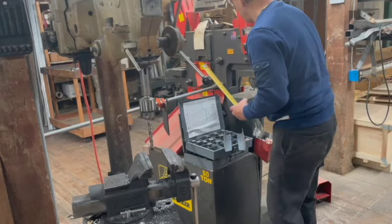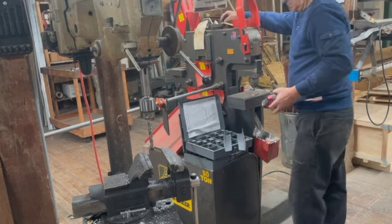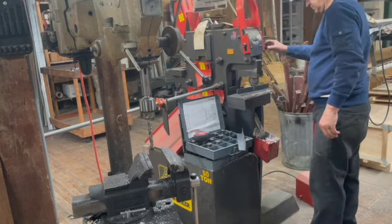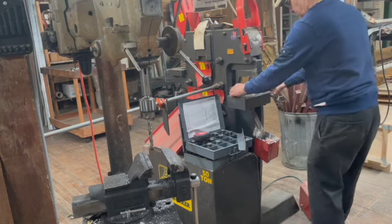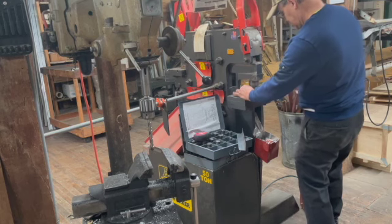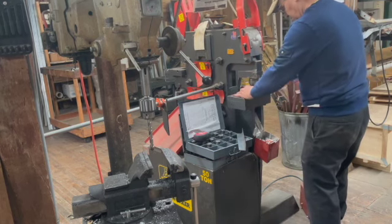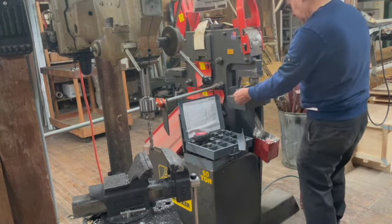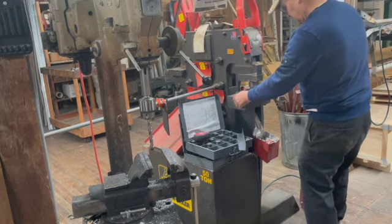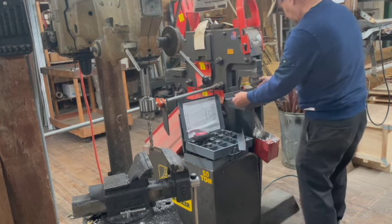I used a grinder to cut the flange off and then took a couple pieces of angle iron over to our iron worker, which, once I put the right bit into it, I was able to quickly punch out the three holes that will be used with carriage bolts to fasten to my 2x12 side of my bed.